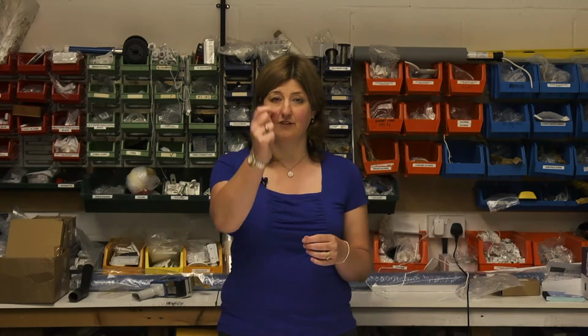And this is ideal if you need to get power, because usually there's a power socket down below and you can just run the power cable up behind the curtain. We can also do batteries. This locks onto the bottom of the motor and then is taken away to recharge. If you have a suspended ceiling, we can also flip the track so that the motor goes up, but that is quite rare. And finally, it doesn't matter which side you need to put the motor on. We will get that specified so it can go left or right.